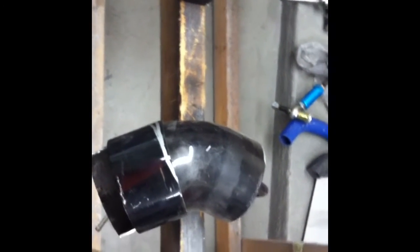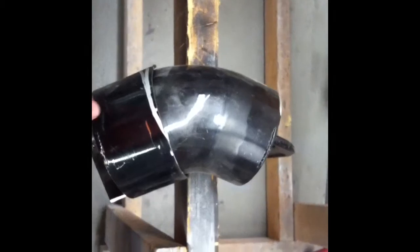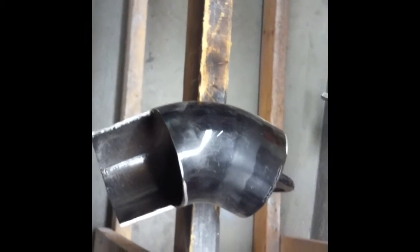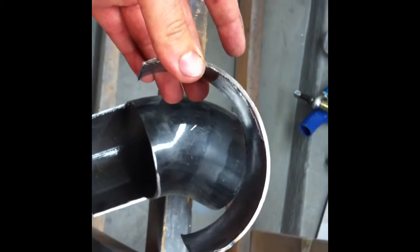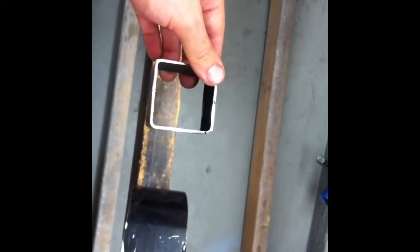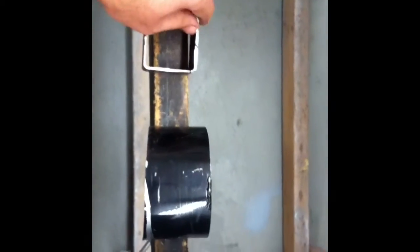While we've got the motor out of the car, we are going to do a little bit of clearancing on the crossmember — the transmission crossmember, the one that's in there from the factory, which also provides support for the floor pan. We've got to clearance it to put a three and a half inch exhaust in there, so we've taken a piece of four inch pipe and cut a half moon out of that to create a clearance piece. On the other side, we've got to clearance it to get fuel lines and battery cables up to the starter, so we're going to put a little two by two slug in there and create an alleyway to route those through.